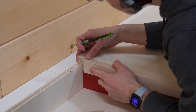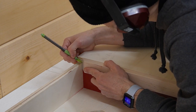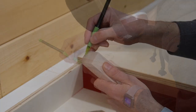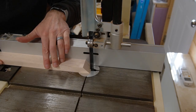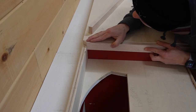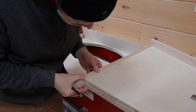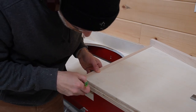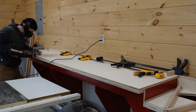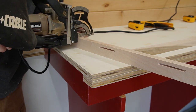I ripped three-quarter inch maple into inch-and-a-half strips and worked my way around the station, cutting one miter at a time. For specialty cuts where I needed to notch the miter I used the band saw, but all other cuts were done with a miter sled on the table saw — I'd cut one under the miter, mark it in situ, and creep up on the perfect fit. To attach the trim I cut biscuit slots along the outside of the top and then cut matching slots in the maple pieces.